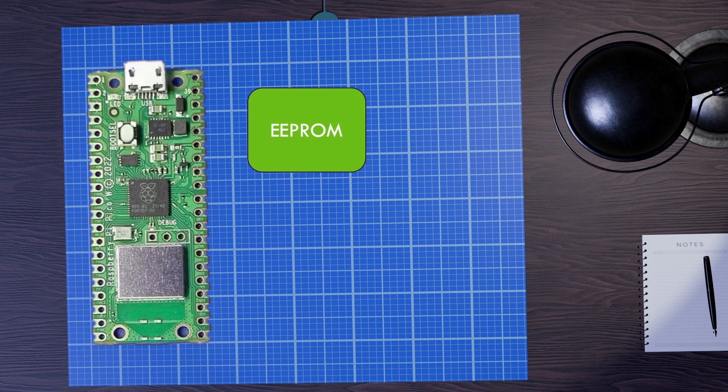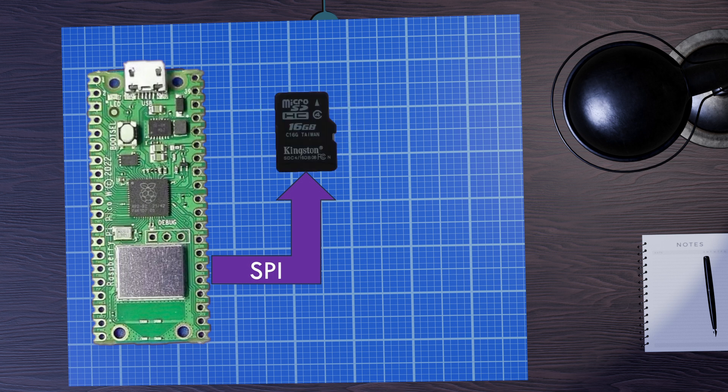So what could we do? Well, we could add an additional EEPROM — that's fairly easy to do and fairly standard, and there are good tutorials out there. EEPROMs come either talking I2C interface, those two wires, a nice easy interface. EEPROMs also come with SPI interfaces, which is a bit faster for pushing and receiving data. The SPI interface is also what SD cards use, and you can just wire a standard SD card directly to an SPI interface and read it. So that's also an option.